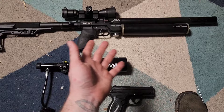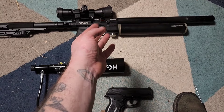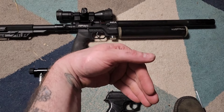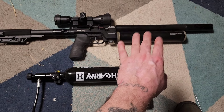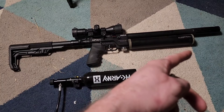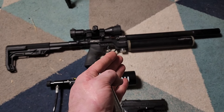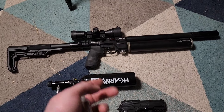For those that may not be familiar, a PCP air gun uses compressed air to power the weapon instead of using a CO2 cartridge or cocking it and using spring power. You are using an air tank that can often be pumped up to about 3500 PSI to fire the weapon. Some advantages of a PCP air gun are air capacity compared to a CO2 cartridge, cost because you don't have to continually buy replaceable CO2 cartridges, higher PSI meaning higher power, and more shots between refills.